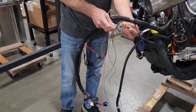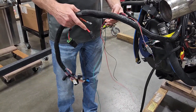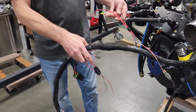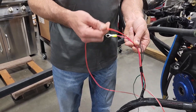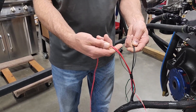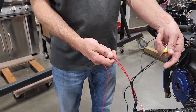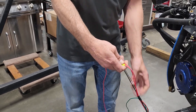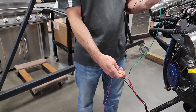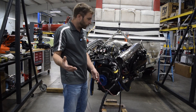You could remove the boat harness or the Holley harness independently. What's left is a small red wire for the MSD box and Holley power. The same applies on the ground side — those two will get tied together and go direct to battery. We also have one wire left, which is our trigger for the fuel pump relay. We don't run the pump directly off this, but it's super simple.